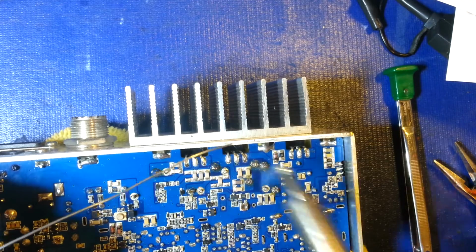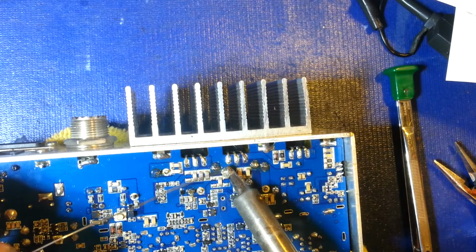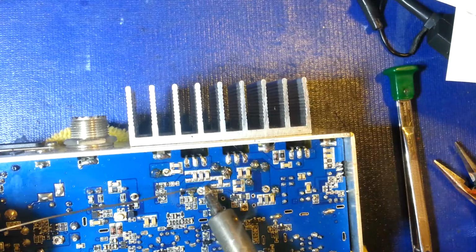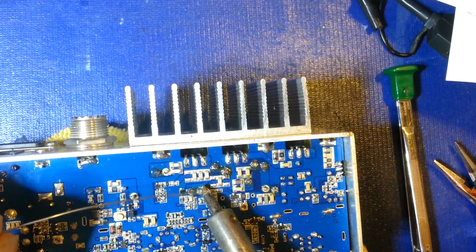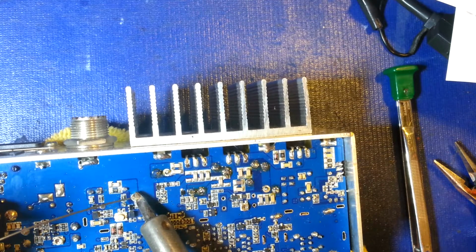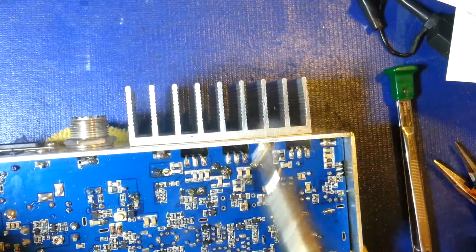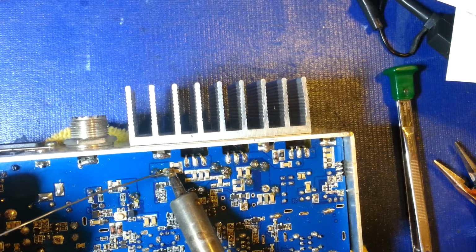And it's not that it's silver solder that makes it shiny. It's because it's a properly done solder connection. If you're just using even regular lead tin solder, your solder connection should still look like that. Very nice and shiny, a smooth surface. Should not be, I often say, crystalline looking, which is almost the appearance you get with cold solder joints, or very rough in texture. Like I say, it should almost look like a mirror.